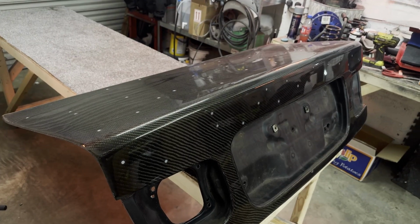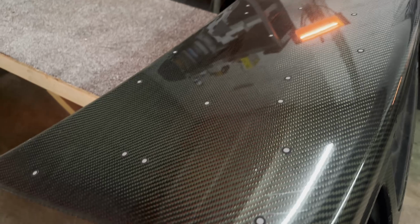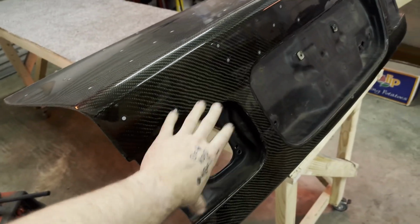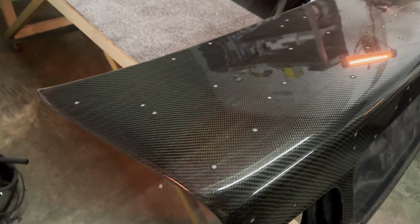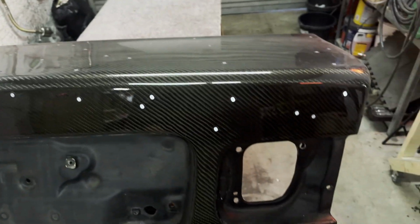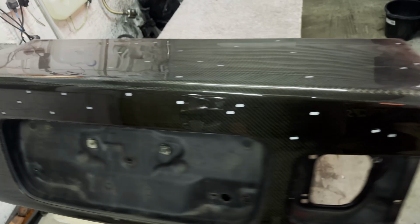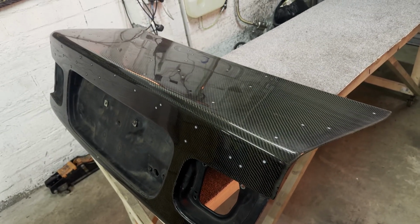Right, first things first, we need to put tracking dots on here. I mentioned how flat surface geometry is difficult to capture, and you can see here these are big flat panels, so it might be alright around the detail and things here, but over the back it's going to struggle to get the flat bits. So the tracking dots you just lay out in any kind of abstract pattern that you want. The idea is you want it to not be symmetrical, repeating, anything like that, so you get weak clusters, you get little spots here and there. That'll help the scanner to determine where it is in space. And then if you bear with me, I'm going to go and grab the head cam, and then we can start scanning.